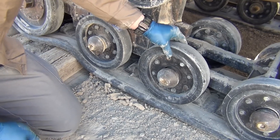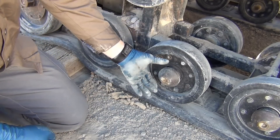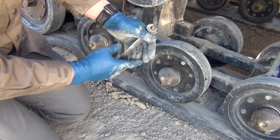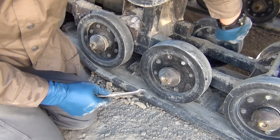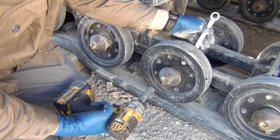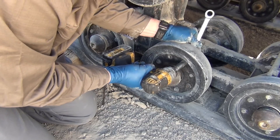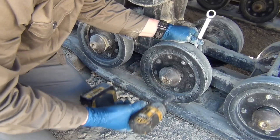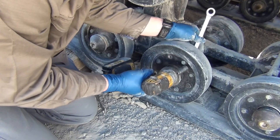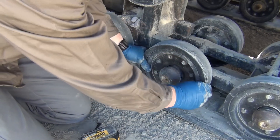The hard thing about this situation is that it wants to move all over the place — it's been worn where you've got a lot of play going on. There's a plate on the wheel and a plate on the back side of the bearing, you can see it on this other side. We've got to get this tightened down. I like to use one of these little impacts to make that happen — you can just kind of line it up, get it where it's just right. You want it to be perfect, right in the middle, so the wheel's not doing one of these numbers — that's just going to cause it to work loose again.